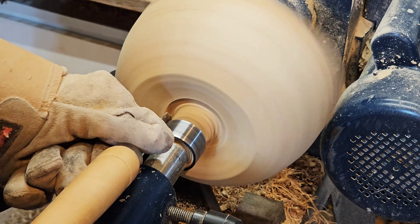Here was a second snag. I didn't get a catch this time, thankfully, but the recess I'm making is from my smallest set of jaws and I just could not get a tool in there to create a dovetail in that little space. It just was not working, so I ended up measuring for my second set of jaws — that's what I'm doing now. I'm redoing that whole recess, which means I have to clear out the bottom of the bowl, and I also have to reshape the outside to account for a shorter bowl.